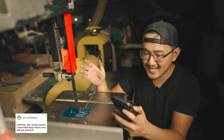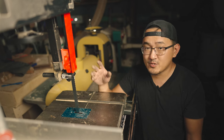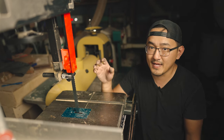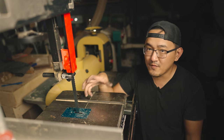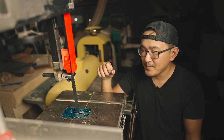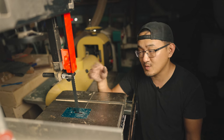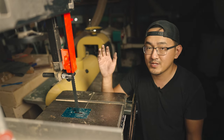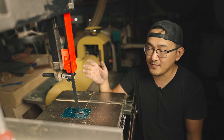W2 Woodshop asks about the setup process — they've tried many methods and still get wild drift. The thing with drift is you want to make sure you're not pushing too hard; if you're pushing too hard, you're going to introduce drift. Don't force the material through the blade. Also make sure you're using the right blade — if you're going to resaw, use a resaw blade; if you're going to do curves, use a thinner blade.